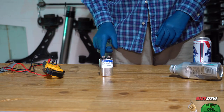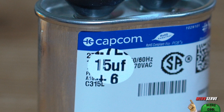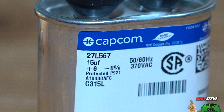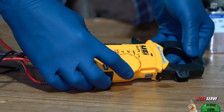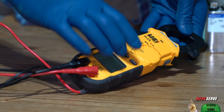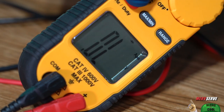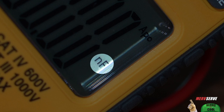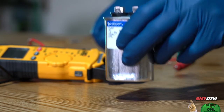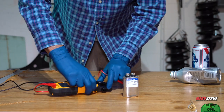Here's a new capacitor — I'm going to test it. It's rated for 15 microfarads, and I'm going to test it using that same multimeter. A lot of multimeters don't have microfarads as an option, but this one does. I just rotate to this position and hit the selector switch three times until this symbol shows up, which is actually nanofarads. Reading microfarads takes a minute.